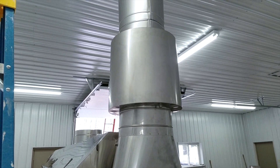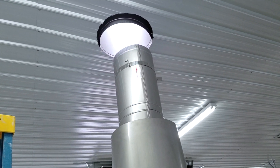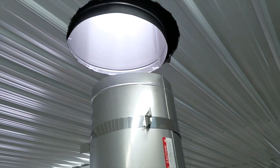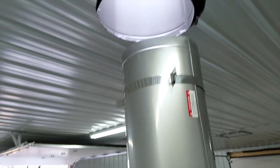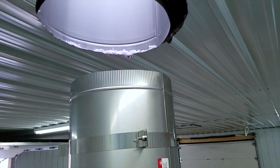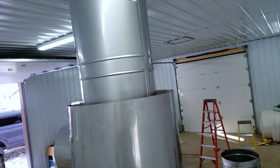We have a unique situation here — we're trying to get big pipes through the roof and through the ceiling liner panel at the same time because we only have a couple of feet. We don't have any room to work in the attic. The attic has rafters eight feet on center so there's no real way to walk up there. We actually have a piece of the outer pipe resting on that ceiling liner panel right now. We have three sections of the inside pipe screwed together already, and we're going to slide that up inside the outer pipe and nest it on the internal pipe, then drop the outer pipe over the top.